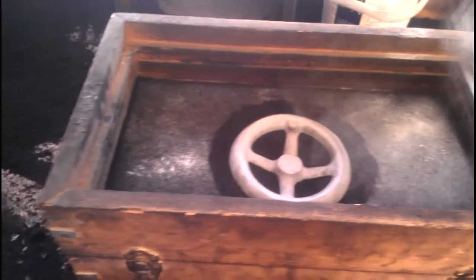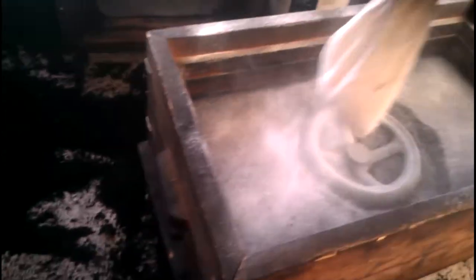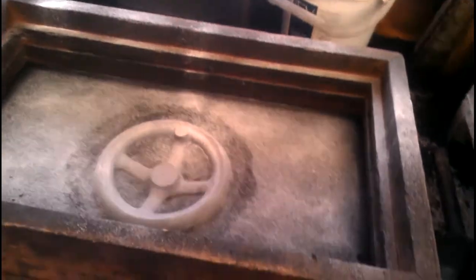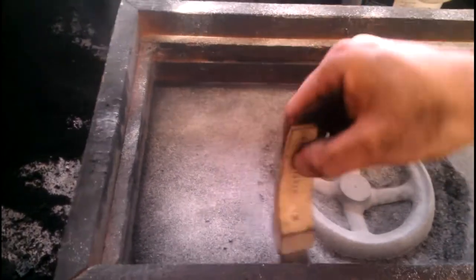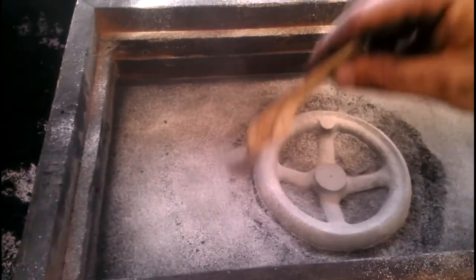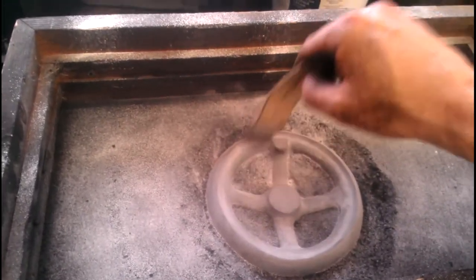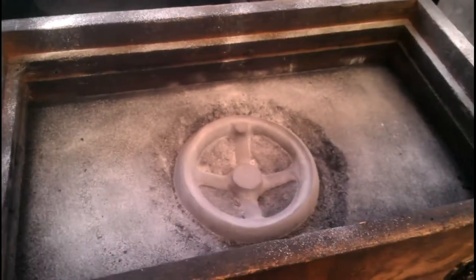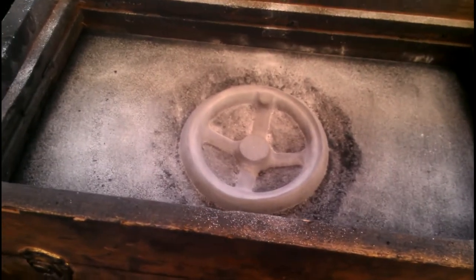Back to our parting dust — this will keep the two halves of the mold from sticking. A lot of people get confused about what a pattern versus a mold is: the mold is the shape, the impression left by the pattern in the sand. In lost wax casting it would probably be in plaster or something like that. We dust this stuff all around, making sure not to put too much — it can actually ruin the texture of your part.